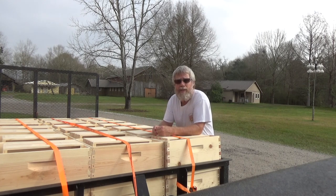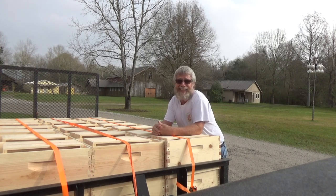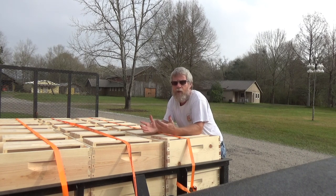You can paint them after they come out of the vat, but by the process it virtually eliminates the need to paint. The wax will prolong the life of these boxes at least by 60 to 80 percent. These boxes can last up to 10 years. So the investment of dipping these boxes as opposed to painting them and replacing them over the long term of that 10 years — it's a worthwhile investment.